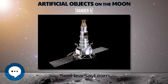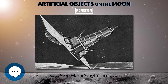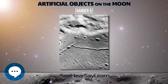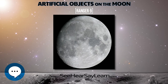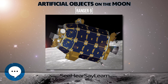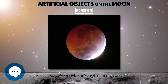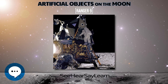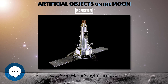Two 1,200-watt-hour batteries rated at 26.5 V with a capacity for nine hours of operation provided power to each of the separate communication and TV camera chains. Two 1,000-watt-hour batteries stored power for spacecraft operations. Communications were through the quasi-omni-directional low-gain antenna and the parabolic high-gain antenna. Transmitters aboard the spacecraft included a 60 W TV channel F at 959.52 MHz, a 60 W TV channel P at 960.05 MHz, and a 3 W transponder channel A at 960.58 MHz. The telecommunications equipment converted the composite video signal from the camera transmitters into an RF signal for subsequent transmission through the spacecraft high-gain antenna.